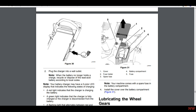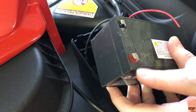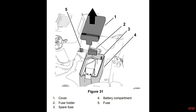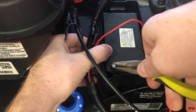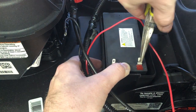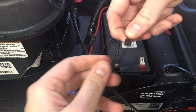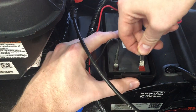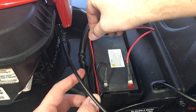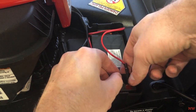Within the manual I found the section on replacing the fuse. The negative is on the left and the positive is on the right. Technically this was in the opposite direction of how I had this battery in the case. What really threw me off was the way that my terminals were bent — they're bent towards the outside of the battery, however the image in the manual makes it look like they are either straight up or even pointed towards the center. I very gently used some needle nose pliers to bend the terminals the other direction, doing this very carefully because I did not want to snap them off. Ultimately this got me to a position where I was able to fully secure this battery in the case. If you have some more knowledge around this, please share it with me down below in the comments. I went ahead, just as extra precaution, and wrapped the terminals in some electrical tape.